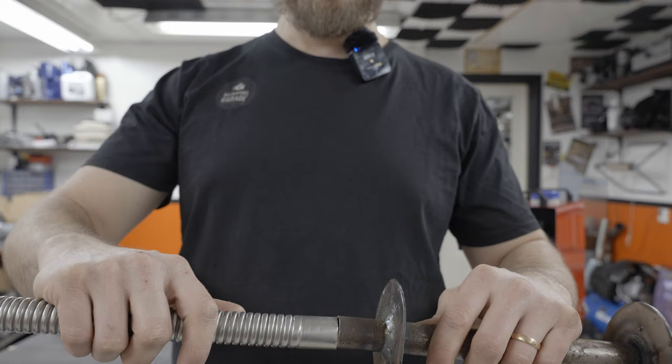Right now, I just want to see that everything works before we seal anything up. How are we gonna do this? Which way are we gonna put the heater and how high are we gonna put it? I wanna try to use as much of the exhaust heat as I can. So I wanna try to keep this as long as I can. So I'll probably bend it right there and we'll fold it straight up and then we'll put the heater somewhere at this level.